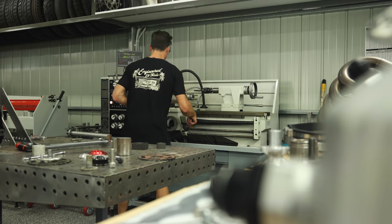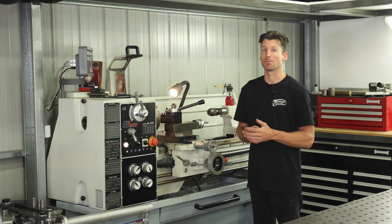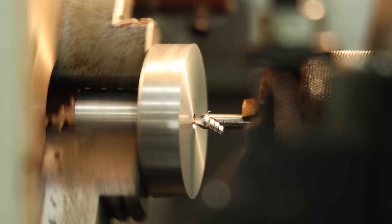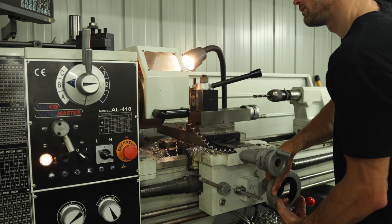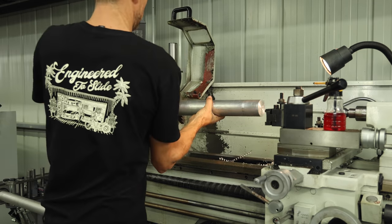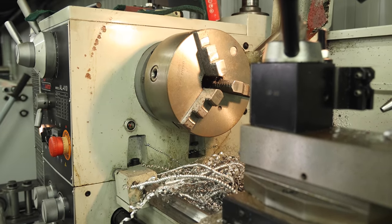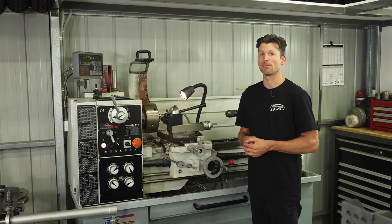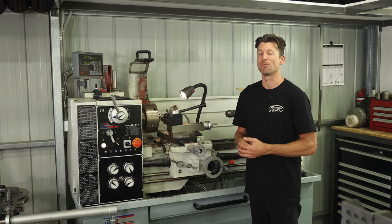This brings us to the lathe, one of the last machines on the back wall, and this is something that is my specialty. I am a qualified fitter and turner and spent many years at Ford product development machine shop operating one of these. I really appreciate having one in the workshop as it took me many years to afford. This particular machine has a length of one meter and a bore of two inches, which means I can fit two-inch tube right through the center — really handy for roll cage tubing. I can polish it quite easily by extending it in and out. A lathe is a tool you grow accustomed to, with its own little quirks. Understanding how they work is something we'll be talking more about at Engineered to Slide, and we'll be doing a course on operating one.